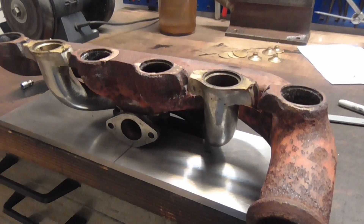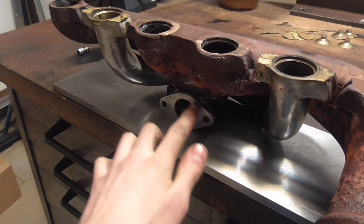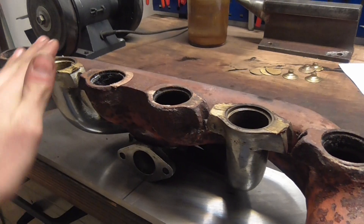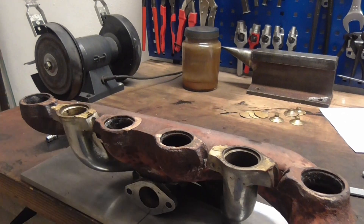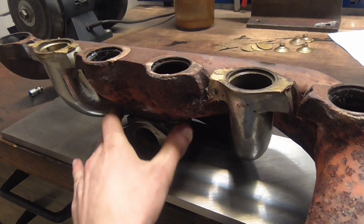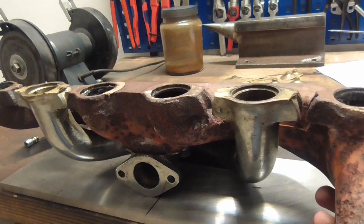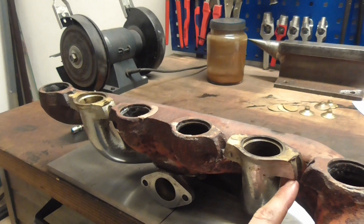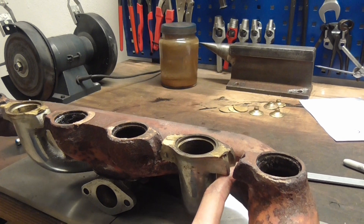The complex geometry aside, we have a rather simple problem. We've got two reference surfaces — this one here and this one as well. These ports have to be perpendicular to that, and we want this thing straight and not tilted. For that, it makes sense to put a block right here, mount the flange right to that, and still have it able to rotate in either direction. We can accomplish that by putting some kind of spacer in between, screw it in or out and therefore tilt it one way or the other.